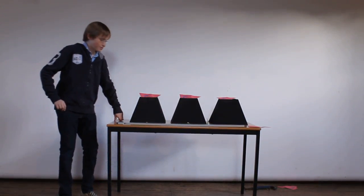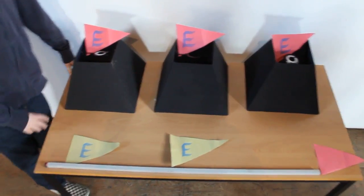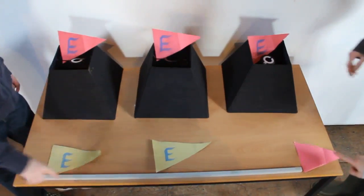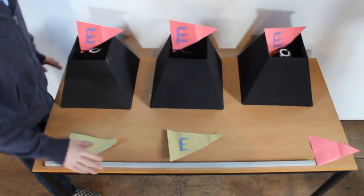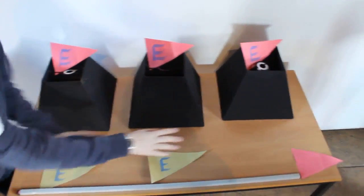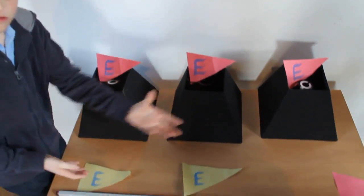Let me illustrate the next process. Here we have the final part — a cross-section of the electrolysis process. We have three positive electrodes, otherwise known as anodes. And at the bottom we have a massive negative electrode, also known as a cathode, which lines the inside of the tub. The aluminium, which has a valency of plus three, is attracted to the negative electrode, because positives are attracted to negatives.